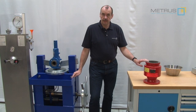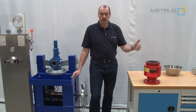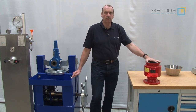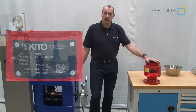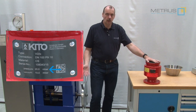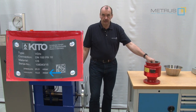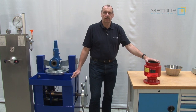But how can we test such a breather valve? We need to test into the positive pressure, but also the negative pressure — meaning vacuum — to be sure that the function is there and also to determine at which pressure it will open. On the name plate we can see this valve will open against overpressure at 20 millibar and it will open under vacuum at minus 10 millibar. So very, very low pressures.